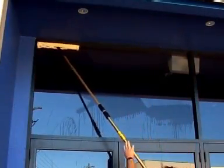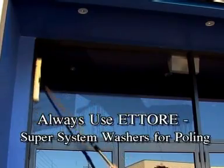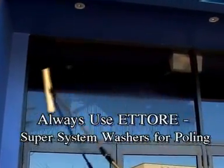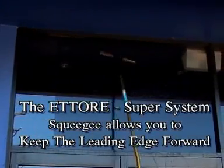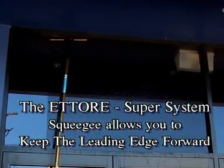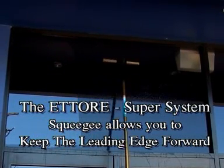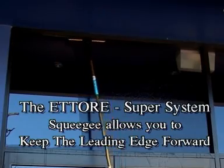When you need to wash windows up high using a pole, you will need to use a larger washer, and make sure you use the Super System T-bar. This will allow you to wash the windows more quickly. When squeegeeing high windows on a pole, always use the Super System squeegee. The squeegee can be adjusted to make sure the leading edge can come down the glass first. Or if you are squeegeeing across, that the leading edge comes across the glass first.